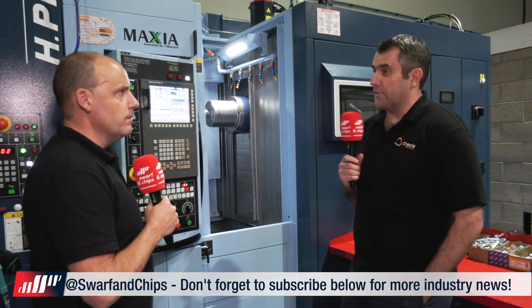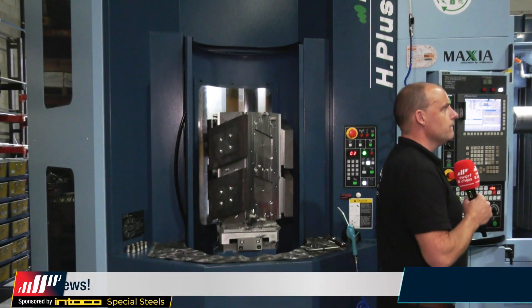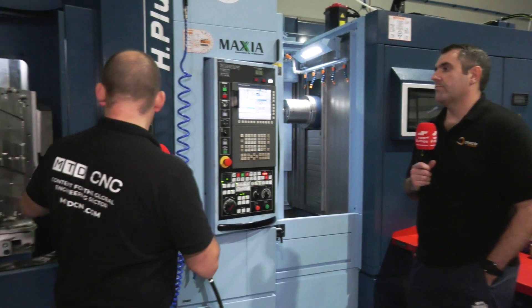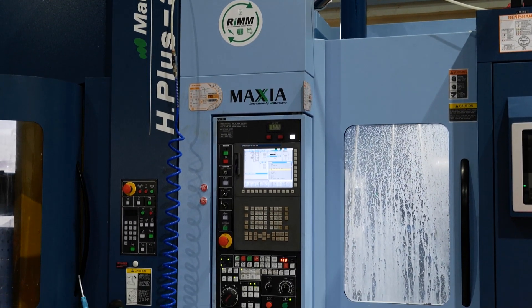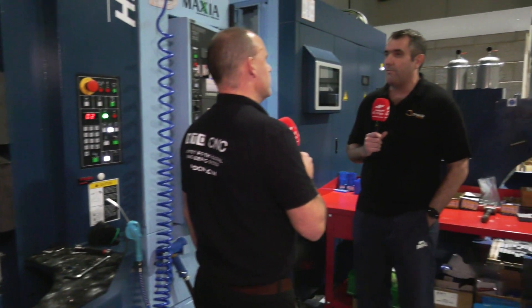The idea when we conceived this was that for certain repeat jobs — monthly or bi-monthly — we think we can gear all 15 pallets up. Not only can we run continuously 24 hours a day if the customer needs it, but we can also load up on a Friday afternoon and the machine will still be running Monday morning when we come in. Are you okay doing that on harder materials? Yes — we work the material, we set all tool loads so if a tool starts wearing it knows to change out to the next sister tool. We're confident we have a stable process, which is why at this moment it's not yet running around the clock — we're setting all the parameters and then once we're happy, like with the MX330, we just let it go.